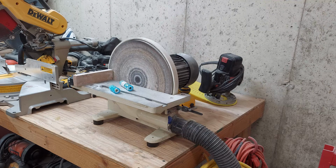That said, how we got to the point where we're at now is we took the blanks and we opened the kit instructions for whatever kit it may be, and we cut the blank oversized, but to size to fit whatever pen barrels or keychains or whatever the project requires. We cut the blank down to length, and then we drilled a hole into that blank with whatever tube that we have to put in, provided the kit needs a tube. Some of these kits don't need a tube.